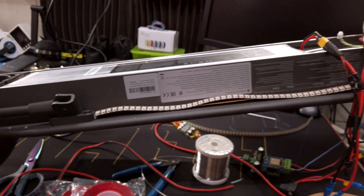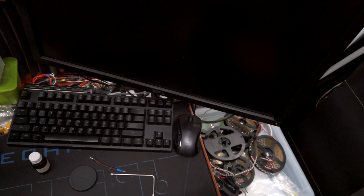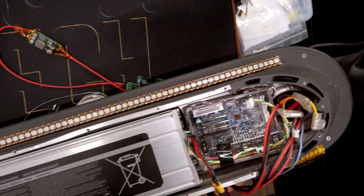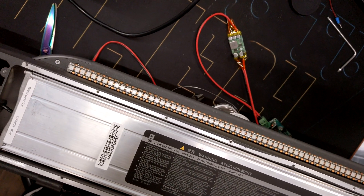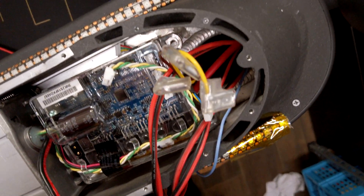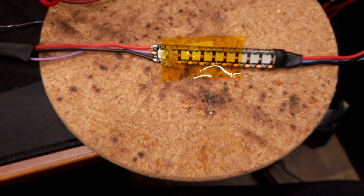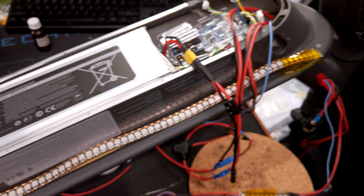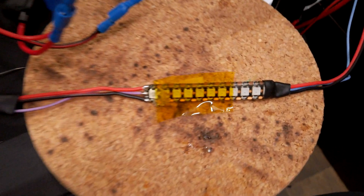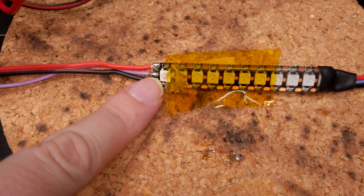So I cut my piece for this side, and then we have the piece for the other side like that. With these LED strips you have to make really sure that the arrows are all pointing in the right direction. I need this little piece because on the end of it I'm going to attach two data wires to basically split the signal from here to the two parallel rows that run down the side. Because this is IP65 LED strip, soldering is a bit harder because you have to peel away the epoxy first.